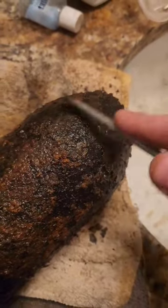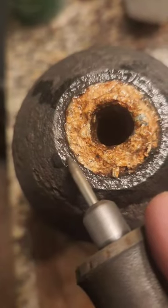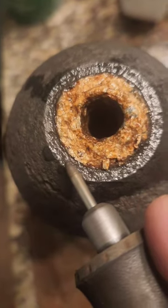After just a few hours in the tank, you can see the rust is just coming right off. After putting it back in to cook for just a few more hours, you can see that most of the rust is gone now, and it just takes a little bit of wire brushing and work with the Dremel to remove the little stubborn pieces of rust that are left.